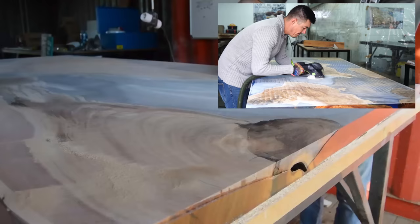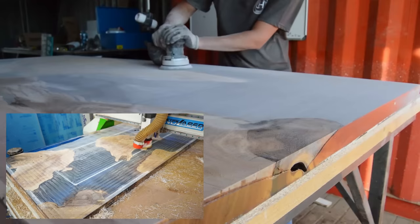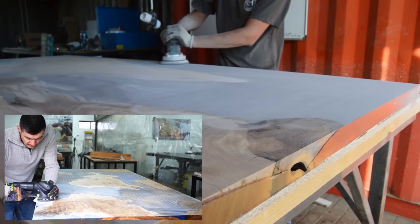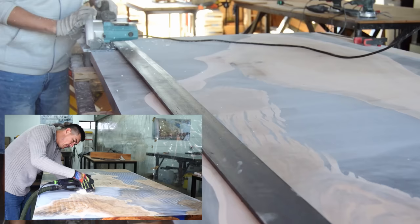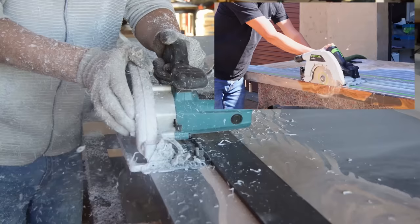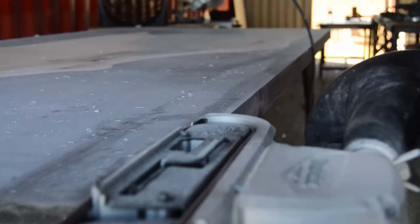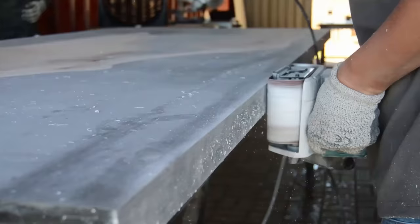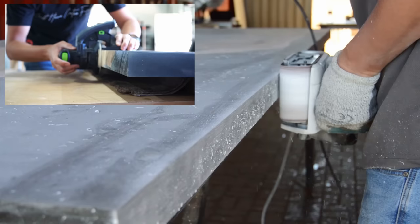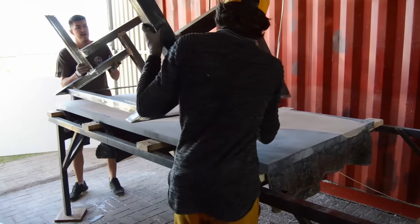After the epoxy set, we previously manually flattened our table on a router sled, but this took way too much time, so we now send it to a CNC supplier that flattens both the top and bottom. With sanding, we started with a belt sander then moved to the Festool Rotex, which has two settings — a rotex mode similar to a belt sander but less aggressive. We also recently invested in a small edge sander from Festool, which is one of my favorite tools and gives you a perfect 90-degree edge.